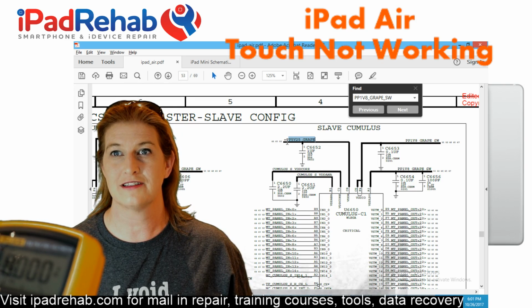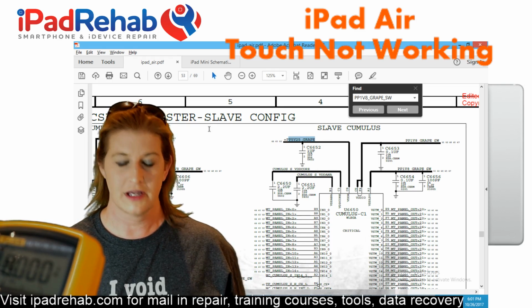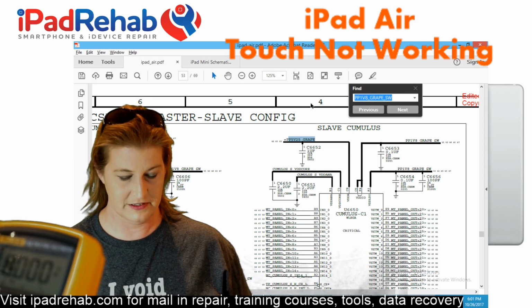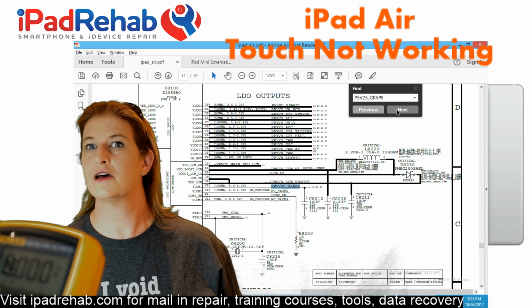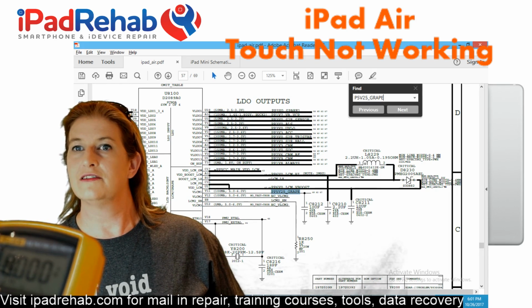Let's find out, where does PP5V25 come from? It's a little bit high to come from the PMIC. It sounds like it would come from some kind of a boost chip. Let's find out. Let's learn about it a little bit. So it does come from the PMIC.